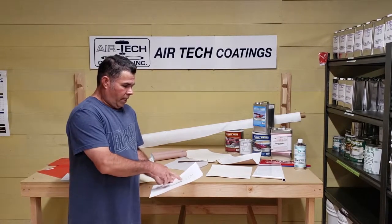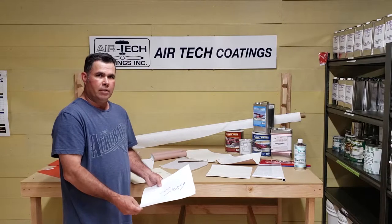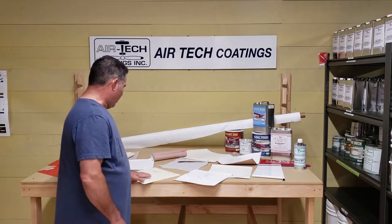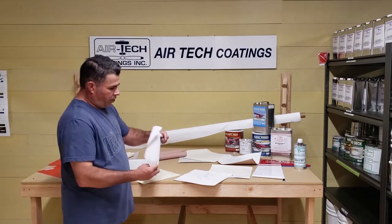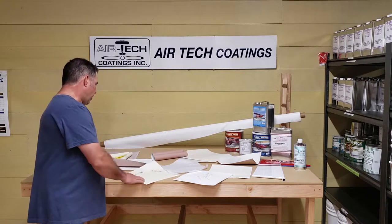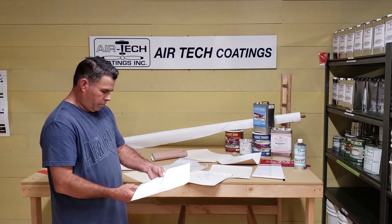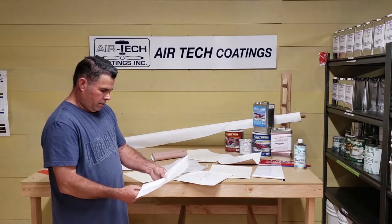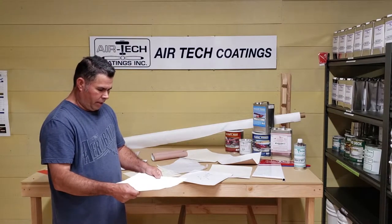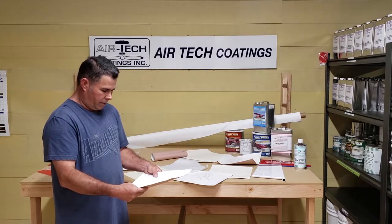Naturally you think, I'm not going to buy anything with urethane because that's heavy. But I kept messing with it. Your regular 102 fabric comes in at 8.8 grams per square foot. Here's one for the old-school poly spray crowd — poly spray, poly tone on, with poly spray, 12 by 12, 38.5 grams. I put enough poly spray on to make it look right — you can see the weave in it — but that's the way poly tone is supposed to work.